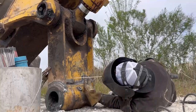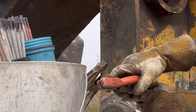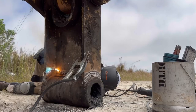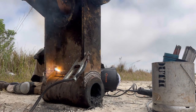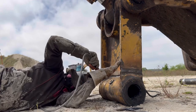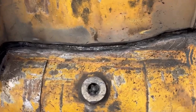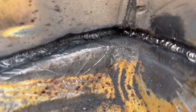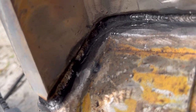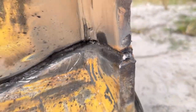And then we're going to put a root in on this side. So here's our root. It looks real slick in the middle, but over here you can see it's not so slick looking. That was the same amperage, same settings — it's just that my bevel's not really that consistent. It looks real slick at the end there, and then up there it's not so slick. What we do is come back with the die grinder and hit that a little bit just to give me a more consistent area to weld over — same thing in these corners. And then we'll go ahead and cap this thing out.